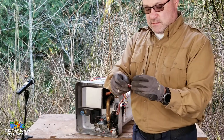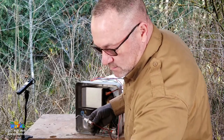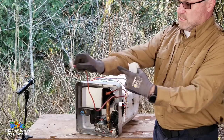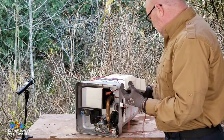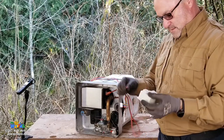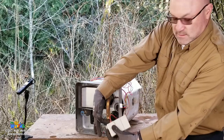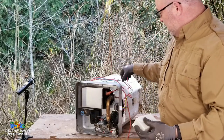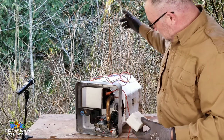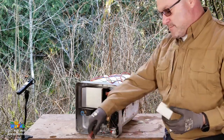And then this electrode wire is connected to it. This then communicates to the DSI board, okay? So one end of my wire is connected to my electrode, and the other end of my wire is connected to my DSI board, okay? So I energize my brown wire here. That opens my gas solenoid. At the same time, I'm striking an arc.